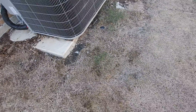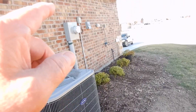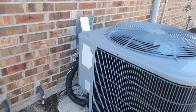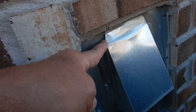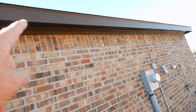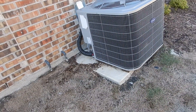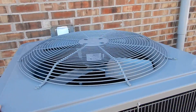In an earlier video I said the condensing unit was hanging off the pad, the disconnect hadn't been sealed, and the refrigerant hood got a hole in it right there. We should have a rain diverter on the roof to keep water from cascading down onto the condensing unit. I apologize if those weren't in the other video — that's the way I work sometimes, first and second passes.